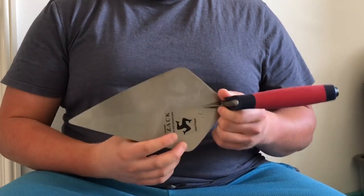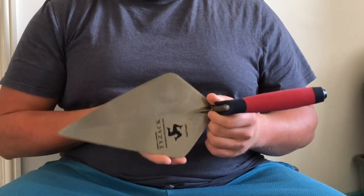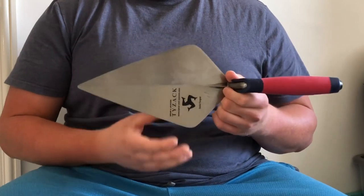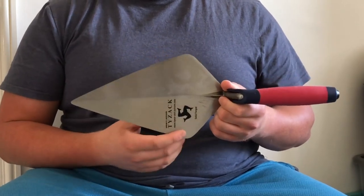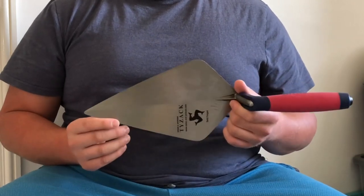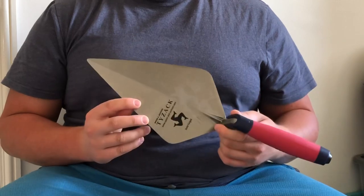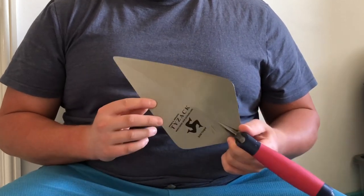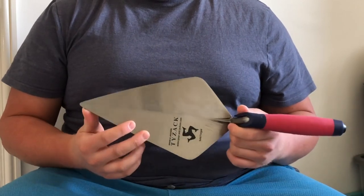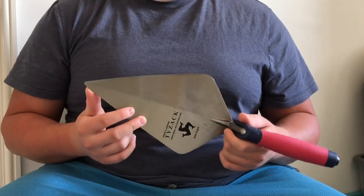When it comes to size, you can hold plenty of mortar on this, especially with the wide heel. I'm not a big fan of this style anymore, even though I used it for a good five months — the wide heel means I don't have as much control over the mortar. But for learning especially, it's definitely ideal. You can get plenty of mortar on a small area of the trowel. It's just to get you going, really — you can use it full-time as a seasoned bricklayer or even if you're coming back into the trade after 10 years off.